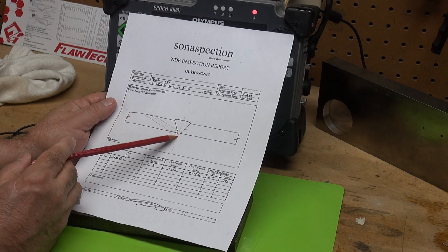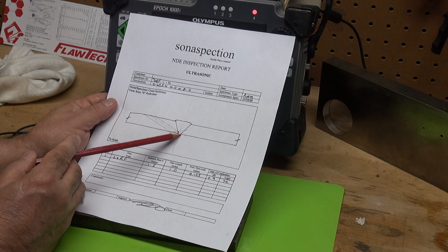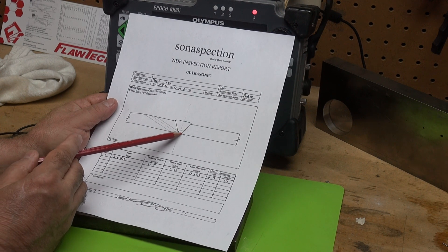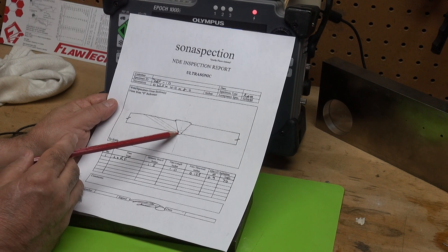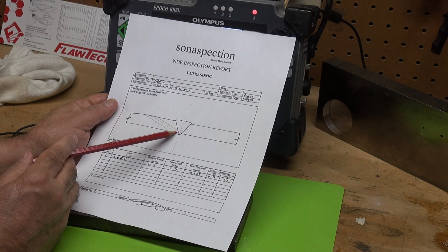Here's a typical root type of geometry where there's good melting of the base metals and the filler metal, and we have a good strong bond. But in this area right here, there was a little lack of sidewall fusion — we did not melt into our machine sidewall.